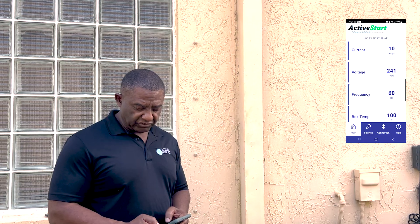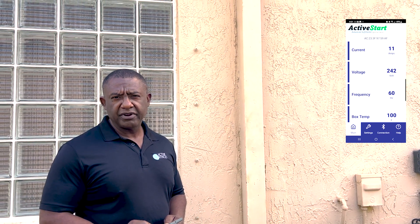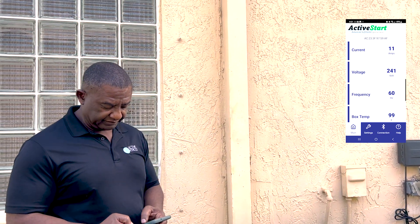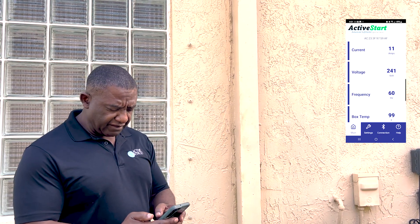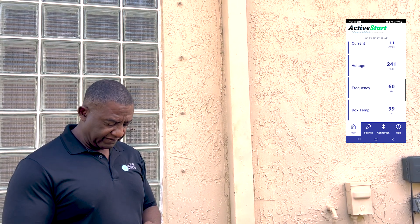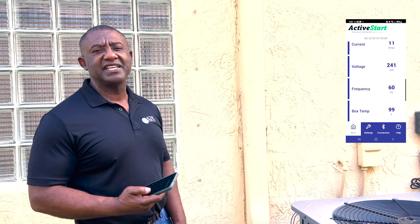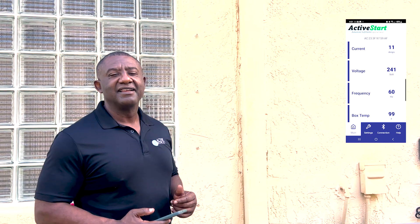At a start previously of 73.3 amps, we now just had a start of 15.54 amps. That's a difference of 57.76 amps — when we do the math, that's a reduction of 79%, almost 80%. The best on the market — Active Controls, thank you.